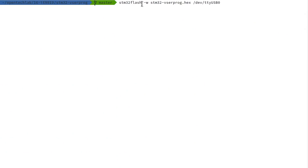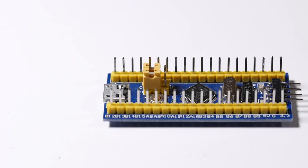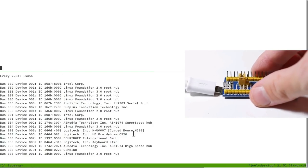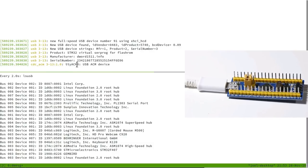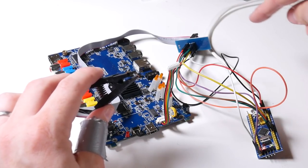On the installation page of the STM32 VSerprog project website I've followed the initial instructions to get my environment ready to build and install the firmware. I've got the repository checked out with all submodules set up, and we can now build the firmware using 'make' with the board environment variable set to 'stm32_bluepill'. It takes a couple of seconds and produces a .hex file, which is what we're going to load into the board. If you work with serial ports a lot I recommend adding yourself to the 'dialout' group on Ubuntu, so you can use 'stm32flash' to load the firmware without sudo. Once the firmware is loaded and the jumpers reset, plugging the device into the PC shows it appearing in the kernel message log as ttyACM0, confirming it's coming up as a serial port through USB.